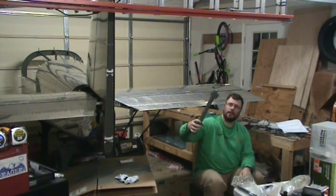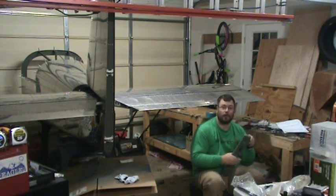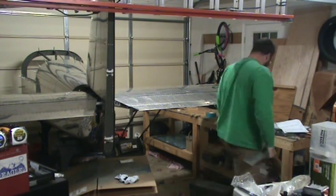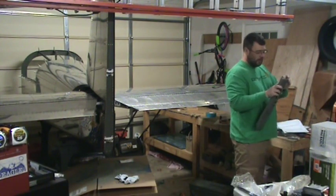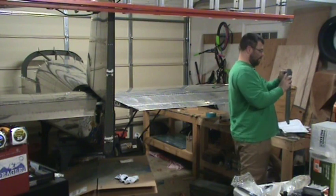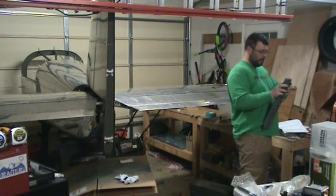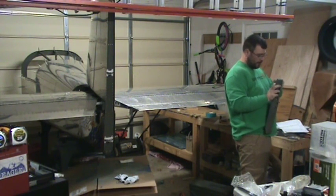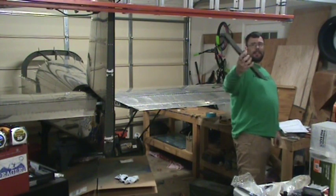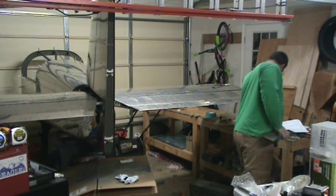But definitely a freely rotating assembly now, unlike before, when I had to really push on it to get it to rotate. Yeah, the more I tighten it down, just finger tight for me, the stiffer and stiffer it gets. So right now, it won't move at all, and there's no way I hit the torque that nut would need to be at. So I'll just back it off to the next castellation until it's loose, and install.